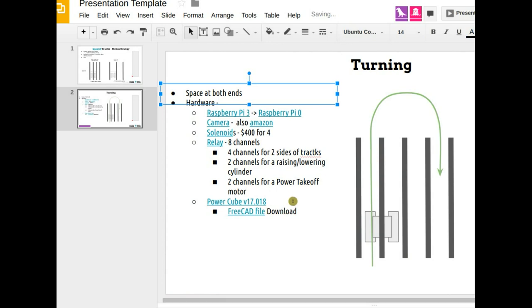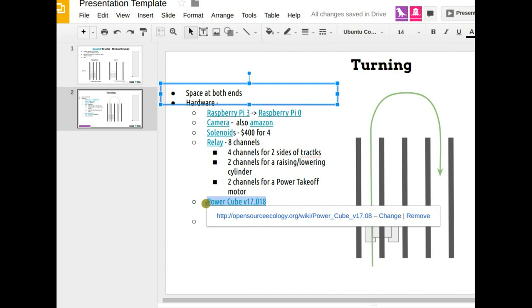Well, that's the big power cube, but that big power cube is the gasoline version. The other part is we will have a secondary power cube with just a solar panel on top of that. So solar power cube, that's not built yet. But what we can do is those solenoids can drive the output of that 16 horsepower power cube, 10 gallons per minute. They can also drive the very tiny, very small flow out of just like a 200 watt solar panel, 200 or 300 watt solar panel. So it'll be going very, very slowly in the daytime.